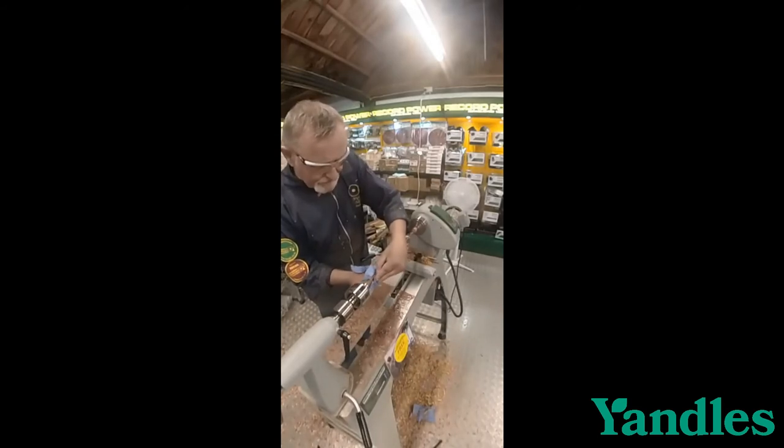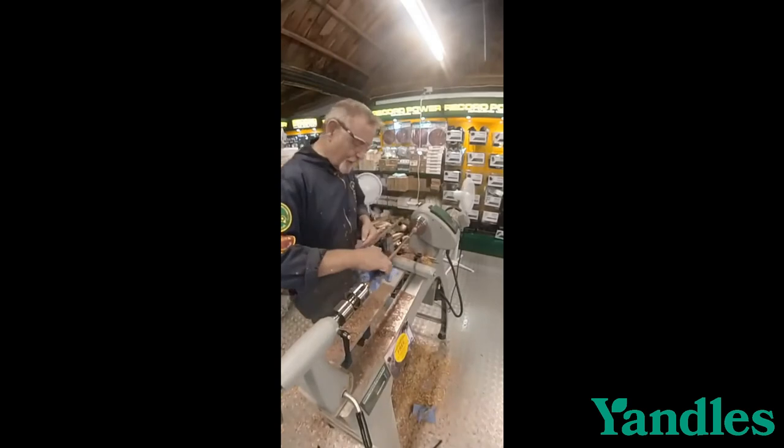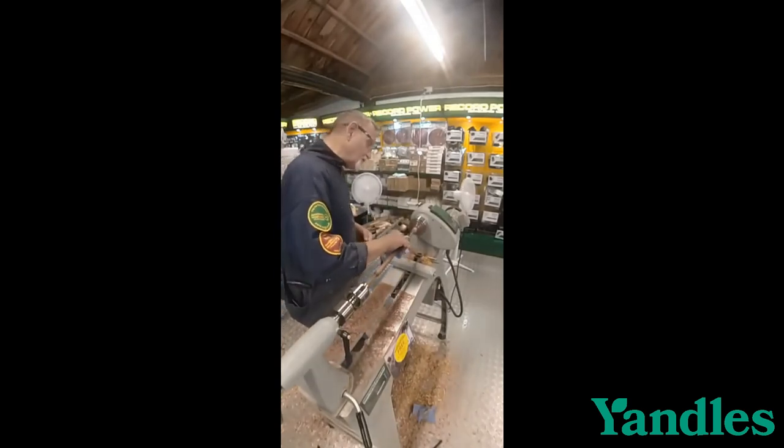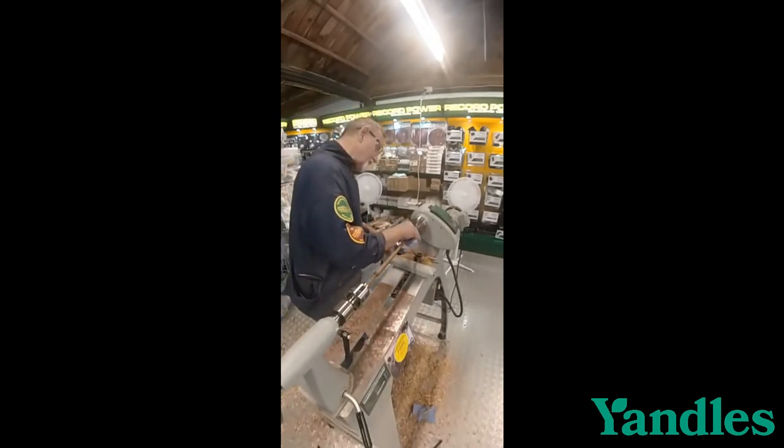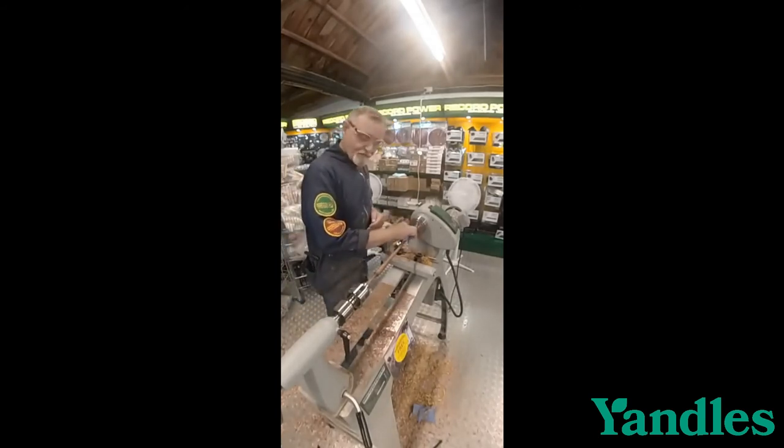It does take a very nice polish. I'm sanding straight up on top of my skew finish. It won't be perfect. I normally get a reasonable finish off of a skew, certainly good enough to start sort of 240 or finer.